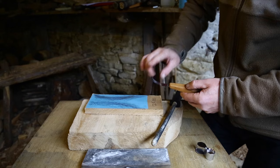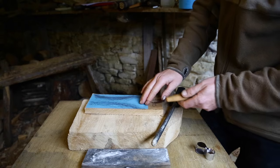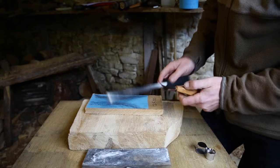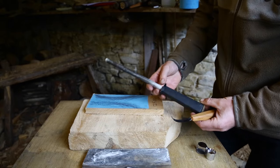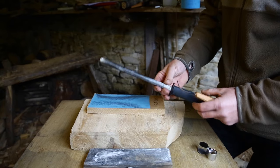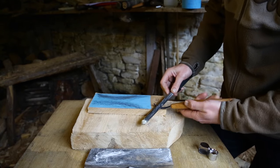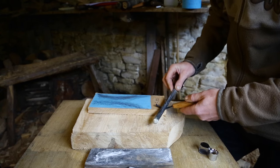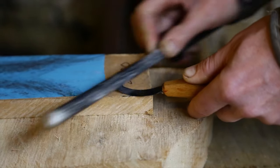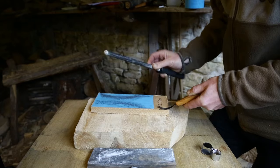What I'm going to do next is take the burr off on the inside. Some people use emery paper wrapped around a dowel — I would advise not to do that. I use something much finer: a ceramic sharpening knife sharpener which you can buy from Ikea for ten pounds. It's very very fine and does the job incredibly well. I rest it flat on the inside of the bevel and just move it backwards and forwards to give it a polish on the inside. That's all it needs.